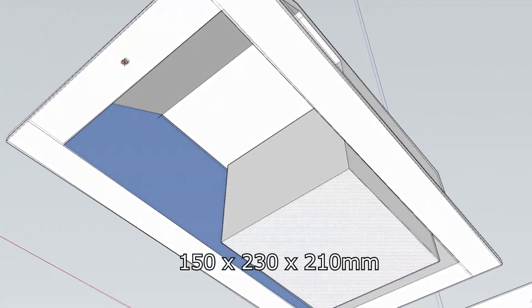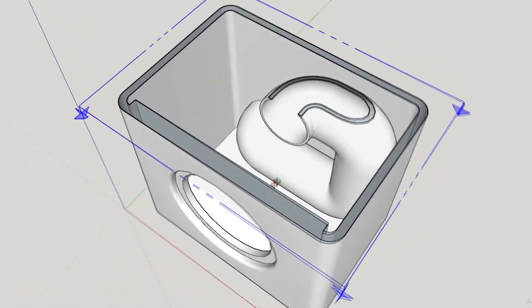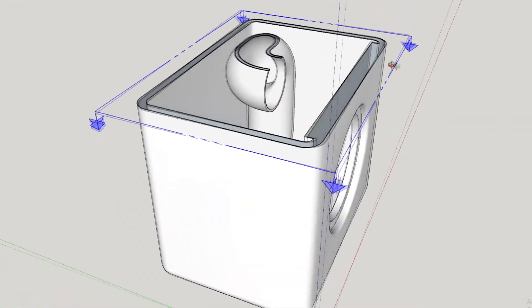The enclosure design can be as crazy as you like — it doesn't have to be a typical cube or conform to the limitations of wood — but it does need to fit within 150mm by 230mm by 210mm. This size represents the typical space in a scaled cabin with back seats folded down. Since it'll be 3D printed, think about supports — for example, a crazy shaped aeroport floating in mid-air won't print easily. The design needs either a separate lid or to be sliced in half for printing two pieces to glue together.